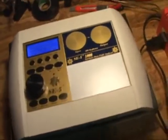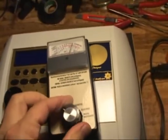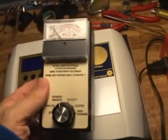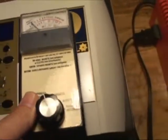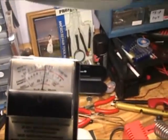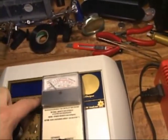So first I'm going to start with the SE5 off. I'll turn it off, and I'm going to check my battery first. Battery's good. And then we'll check for expanded magnetic. Now, laying it right on the SE5, you'll see that the meter doesn't move at all with it off. But if I come up close to this lamp, you can see that it goes pretty strongly as I get closer to the light.